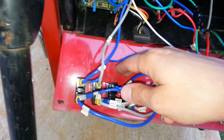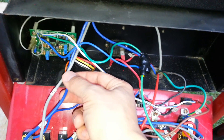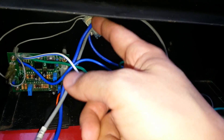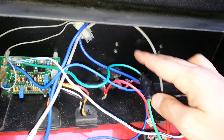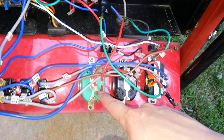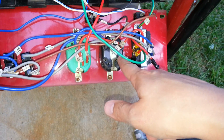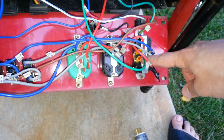This is wire number 11, for the voltage regulator — it's on the line side of the first 30 amp circuit breaker. These are the two main hot wires coming off and they go into your idle sensing transformer here. This is what senses more than one amp of load, then disables the idle solenoid, and re-engages when there's no load. These two wires are looped through the transformer and go back down to the stator. This red neutral wire goes to your 125V 30 amp outlet, which is then jumpered to the neutral on your L14-30, and again jumpered to the 110V duplex outlet.